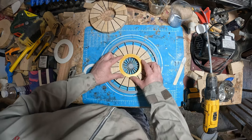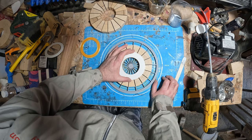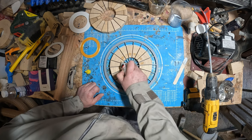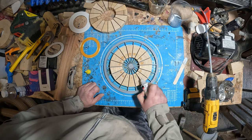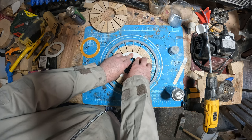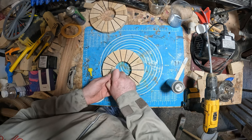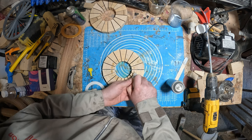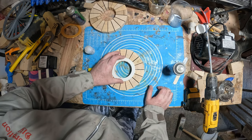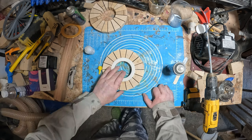The next day I assembled the upper rings the same way, but wanted a thin two millimeter joint between them. Overnight I'd 3D printed some spacers - small enough to fit around the inner diameter but just wide enough to hold the segments apart, and for the profile I was hoping to turn, they would be completely removed. I super glued a printed spacer to either side of one segmented ring, then glued it on top of the other. The rings weren't completely flat so the joint was a bit inconsistent, but I'd already come up with a plan to stop that happening again.